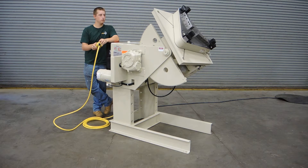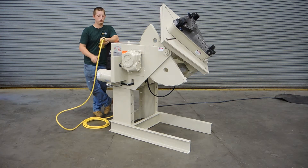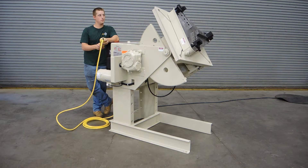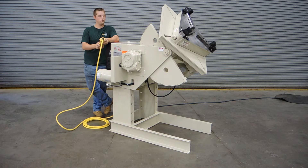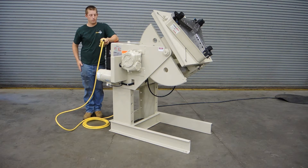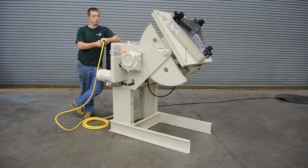If properly used with the center of gravity, your part would freely rotate on this positioner. The speed would be maintained as a constant speed without any variation. If you have variation in rotation speed on a welding positioner with your pipe and elbow, that's usually a strong indication that the positioner is overloaded — that you are maxing out the torque capabilities.